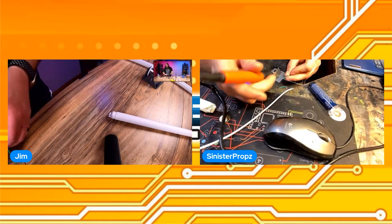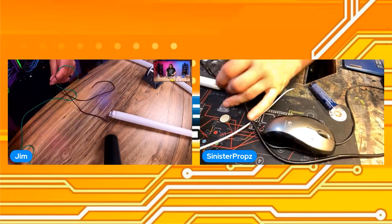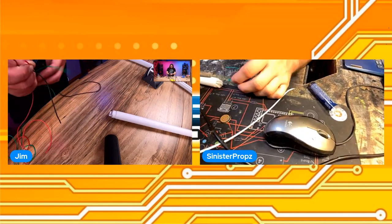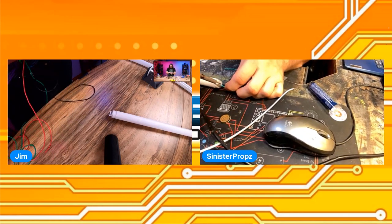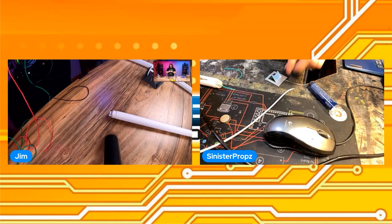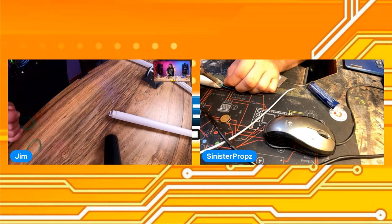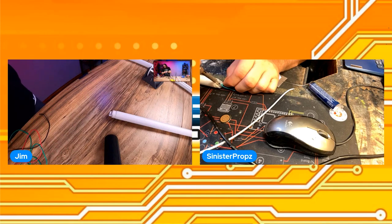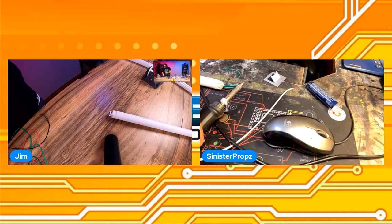So make sure you give yourself an excess. I just cut like an inch, cut one end off, tin one end. Red, black, and green. Oh, I need 6 of those? Yes, so 2 greens, 2 reds, 2 blacks. Got it. I'm going to get ahead of myself and solder this on so that you can see what it's supposed to look like when it's soldered. I'm going to go a little long on these, okay? Yeah, I do about an inch, and that's more than enough. Trust me.